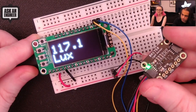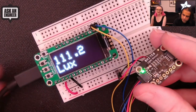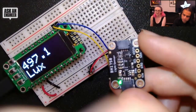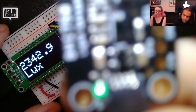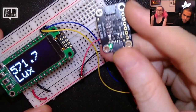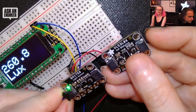It's a simple but really common sensor, so having an easy-to-use breakout is great. Here's the live demo — this is how much lux is around. It's darker, different light... I'll turn this on — whoa, I'm measuring the light coming out of this camera, and it's up to 2,000 lux, super bright. It's detecting how many photons are coming in. You can even chain it with the VL53L0X to do light sensing and distance sensing.